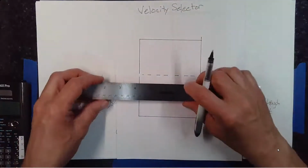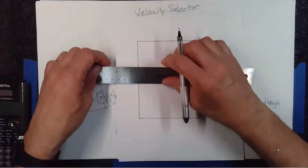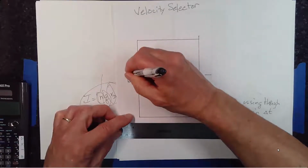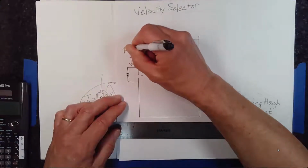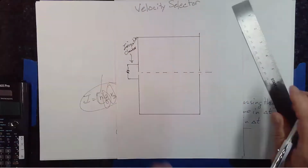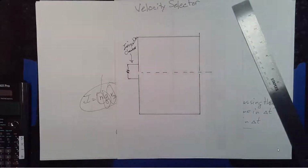Oh, and something that they would have before it got that far is an ionization chamber. And we can just kind of draw that as a little box. And there'd have to be an opening on it as well. And the ionization chamber is just a place, particles are allowed in here from the atmosphere, and particles are going at a good clip, you know, typically 500 meters a second, but that's just the RMS speed. There's a whole range of them.